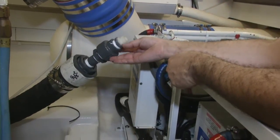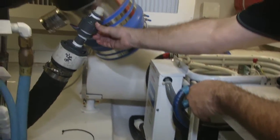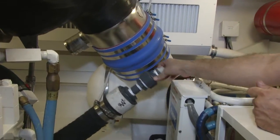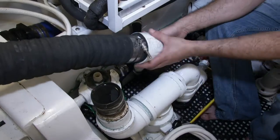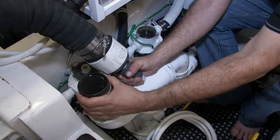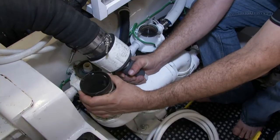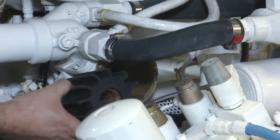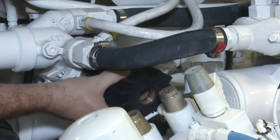With the fittings disconnected, we're going to disconnect our fittings and reconnect our hose back on the hose barb fitting right here. Once this is removed, this hose is going to get connected back over here so that we have a closed loop again. The next part is to reconnect the impeller, put the impeller back into its casing, and close the casing back up.